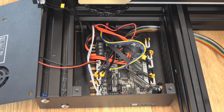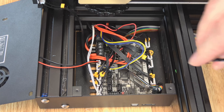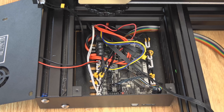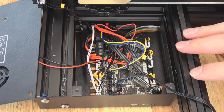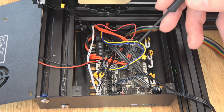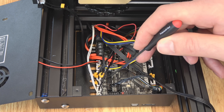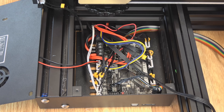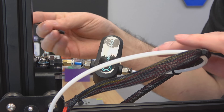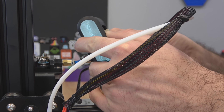Here's the main board we installed in this printer — the BigTreeTech Mini version 3. It has a dedicated E-stop pin right here for filament detect, three pins, and those are already included in the configuration. We'll plug in our filament sensor wire there. Note that if you have a stock Creality board, you won't have extra pins — you can buy a converter that breaks out pins from the LCD plug, usable for a leveling sensor or filament detect, but you'll need to configure that in Marlin. Older boards often had extra end stop pins for X, Y, Z max — you can use those, but again they need to be configured in the pins file. The other end of the wire plugs right into the bottom of the filament sensor.